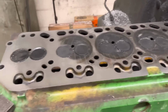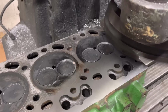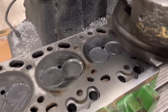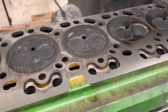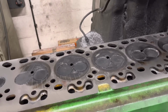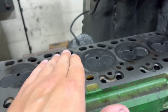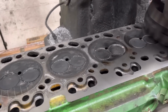So guys, on the John Deere, you can see we've given it one 5/1000 cut. We're on the second 5/1000 cut now, but just going by where it has cut. So it cleans on the back edge and then gets narrower and narrower towards the middle, and then goes further and further out and cleans on that back edge again. So you can see how these sets not just dip like that, but they sort of dip that way as well, and that is usually a telltale sign.